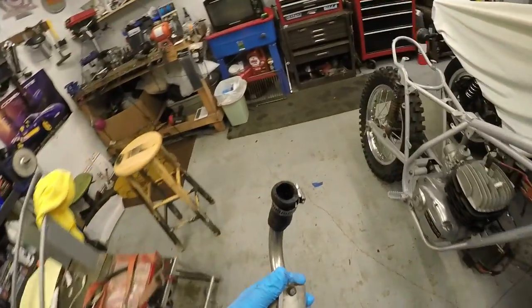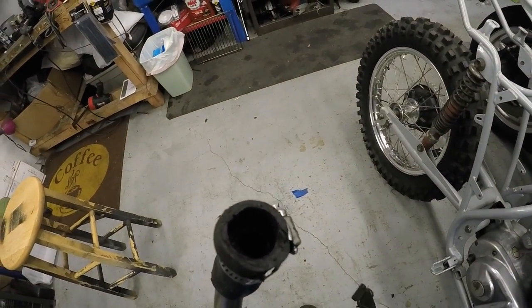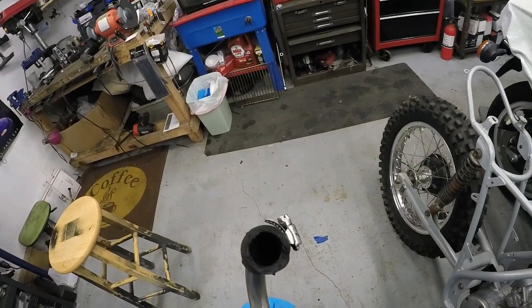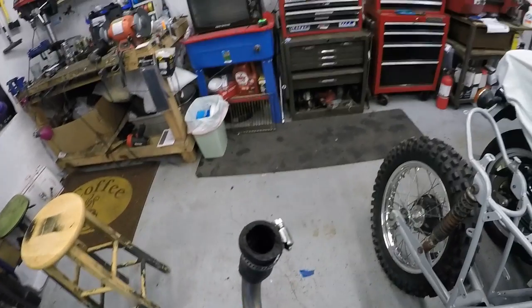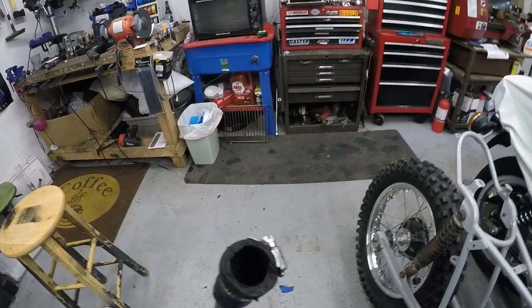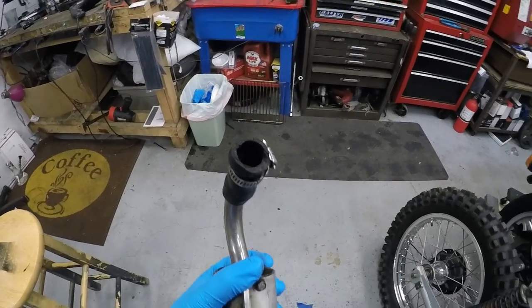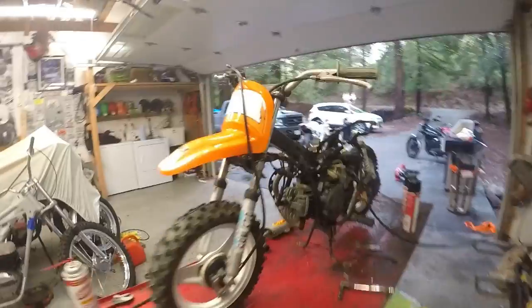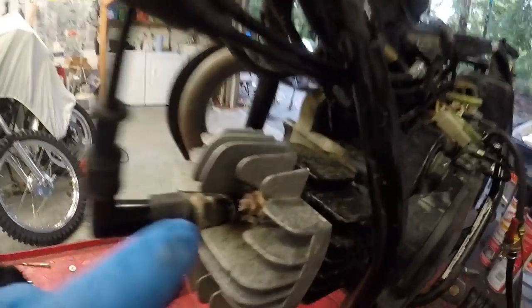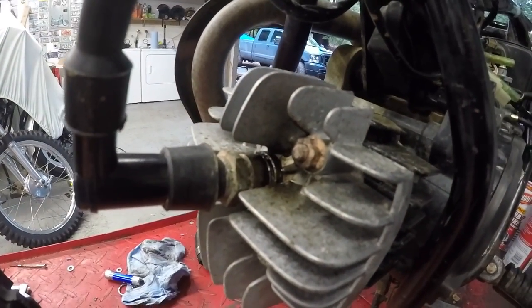Alright guys, I'm going to try to get in some good light here so you can see it, but that is going to be an issue. There is barely anything going on there — and a giant hole right there. Not good on all fronts. We need to make a better clamping system there. With this camera I can get a better view. I know it's loud, but if you look right there you can see bubbles. You should not see bubbles right there — that is not kosher.